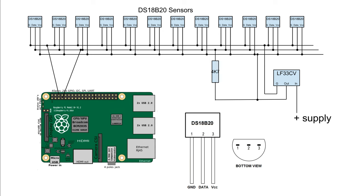They contain onboard capacitors which are charged up when the data line is high and then power the chip while it's low. With the Raspberry Pi that works fine for two or three chips, but the power distribution on the Pi is generally pretty marginal. This one-wire system can be temperamental, so I suggest using the power line and powering them from a source independent of the Raspberry Pi. The Raspberry Pi has pins for powering peripheral components that use either 5 or 3.3 volts. The 5-volt line is limited to 250 milliamps and the 3.3 volt to 50.